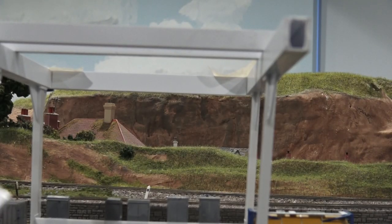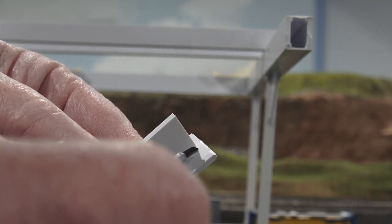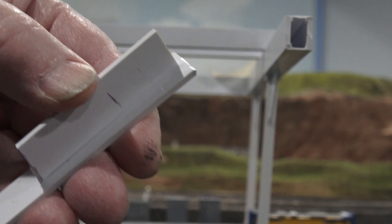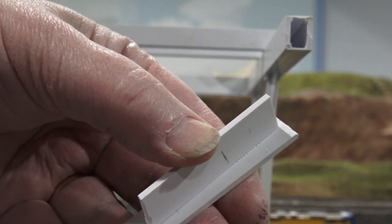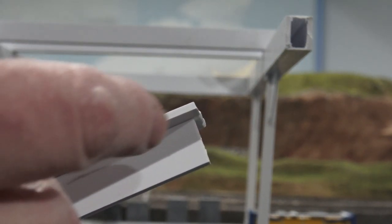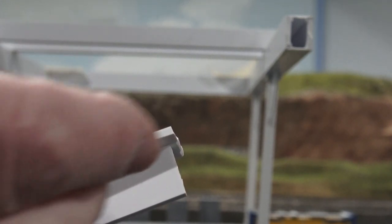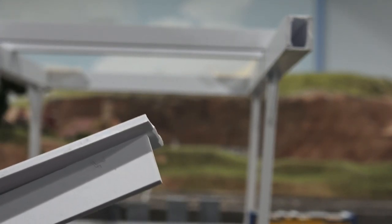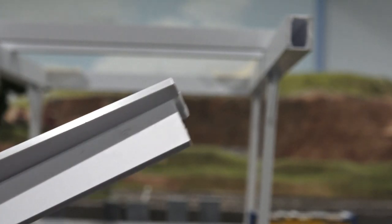However, if I set it to where there's pressure holding it down to minimize the gap and paint a little of this glue on the side of it, then it sticks. What happens is when there is a very small gap between two pieces and you press them together and you put some of this glue near it, capillary action pulls the glue in and the glue melts the plastic together, so it welds it.